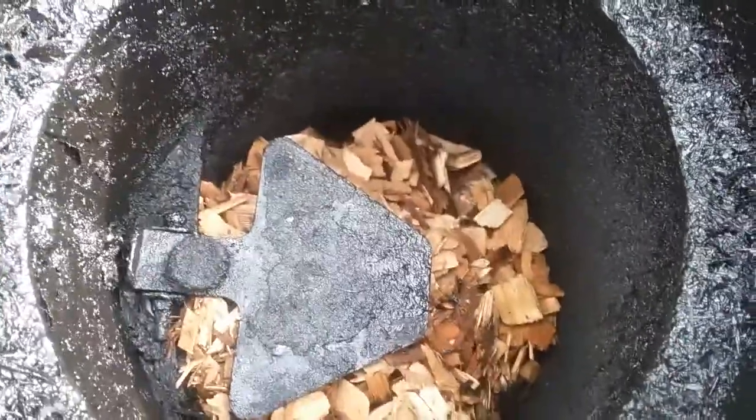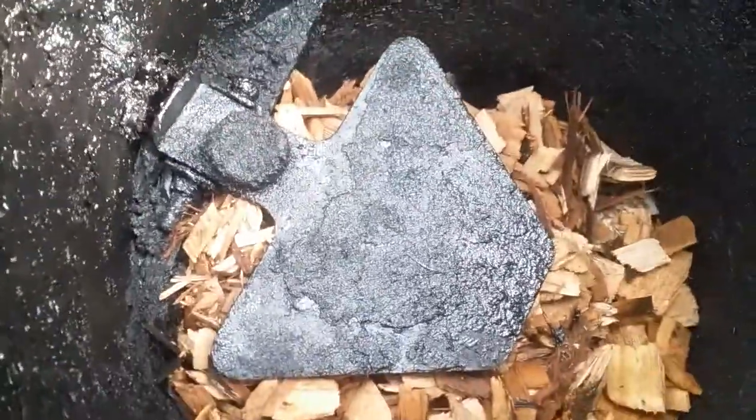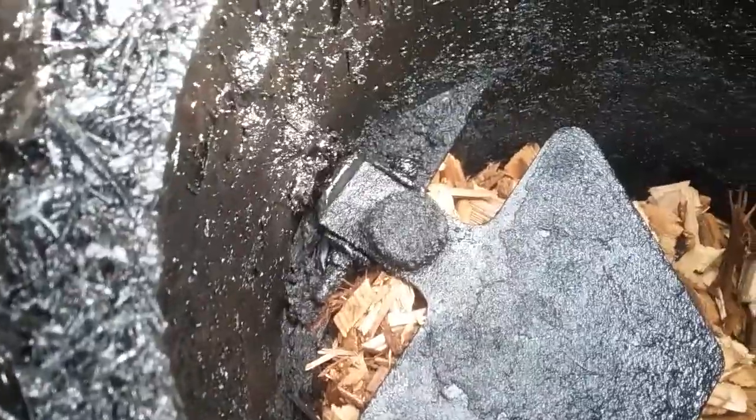The auger's got this topped off — just a simple flap sensor with a proximity switch that reads that sensor. So when the auger feeds in here it pushes up on that flap until the sensor reads it, and then that will shut the auger feed off.